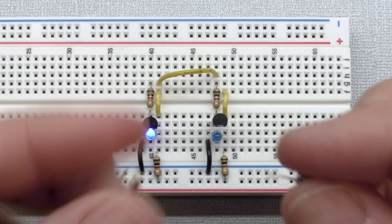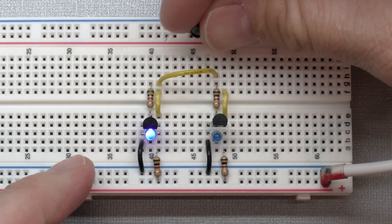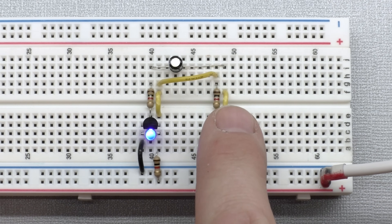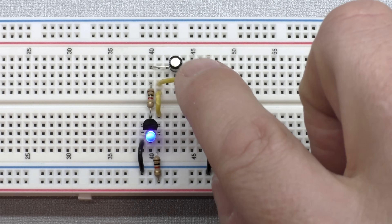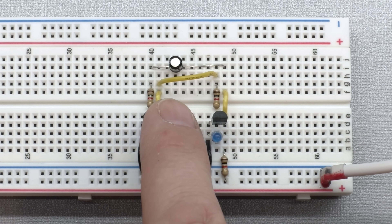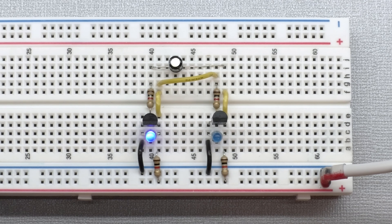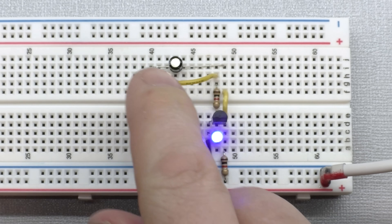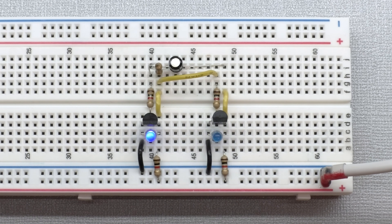To make it interesting and create this oscillator, we have to introduce a delay. To introduce a delay, we're going to use a resistor and a capacitor. We want to take the output of the second one and run it to the input of the first one through a capacitor. And we connect the output of the first one directly to the input of the second one. Because a capacitor doesn't actually pass current, we need a little recharge path with a 10K resistor between the input and output of the first one. This creates a small delay and gives us an oscillation.